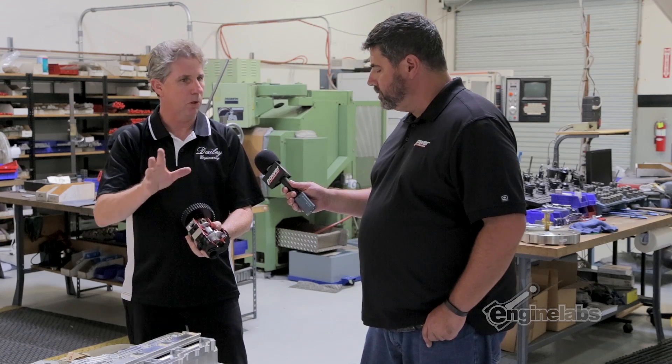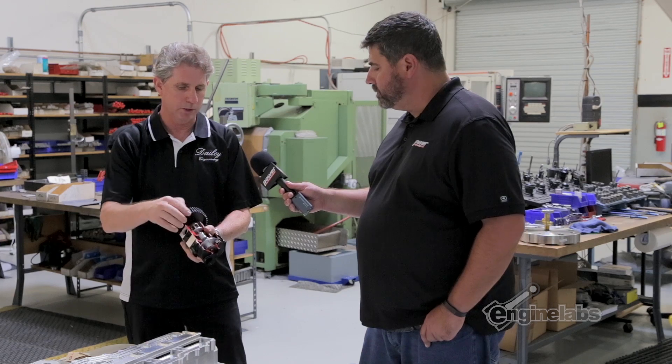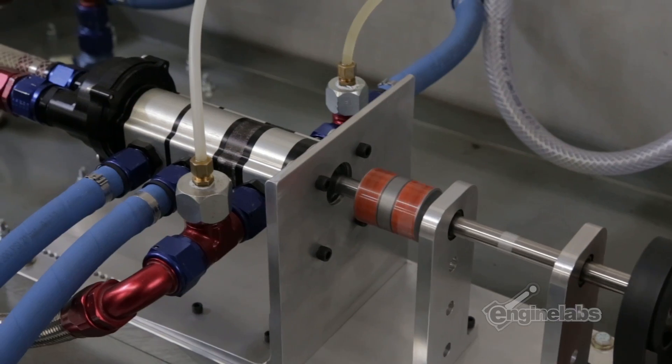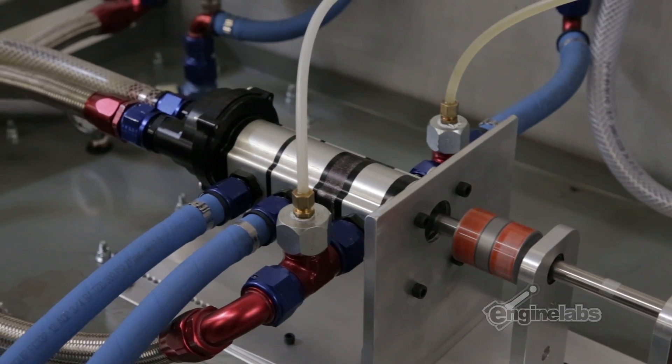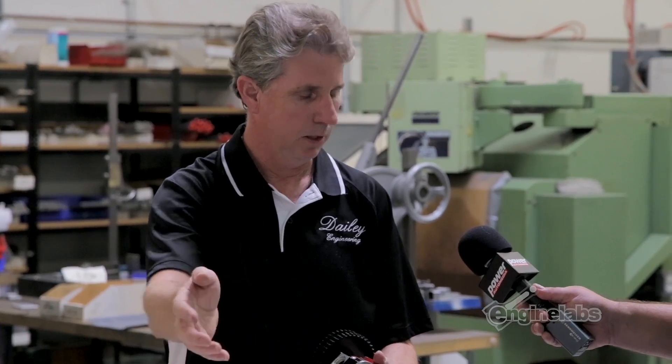The foam comes along and tries to push against it, but the air being lighter than the hydrodynamic forces can't get through the barrier — it burps back down to the center and then spits out the center and goes back to the tank. So all of the blow-by from the motor exits through the air line. Only pure oil exits through the oil line.